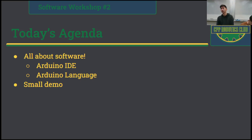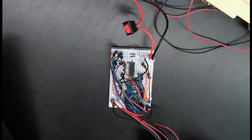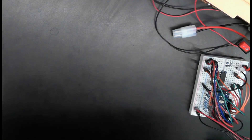Before we get to the IDE, I remember last time we didn't have enough time to get through the LED. Are the LEDs attached yet on your boards? Oh they are? Okay. I'll go over it anyway. If you don't have your LED already installed, go ahead and grab it out of your bag and grab the 220 ohm resistors. They look very close to the 1Ks. Honestly I should have gone for 330s, but they only come in fours.